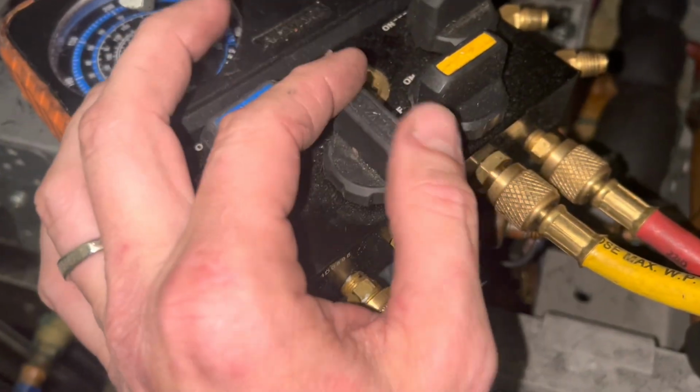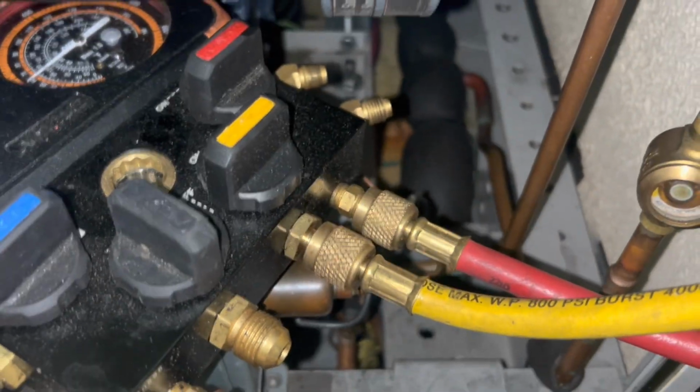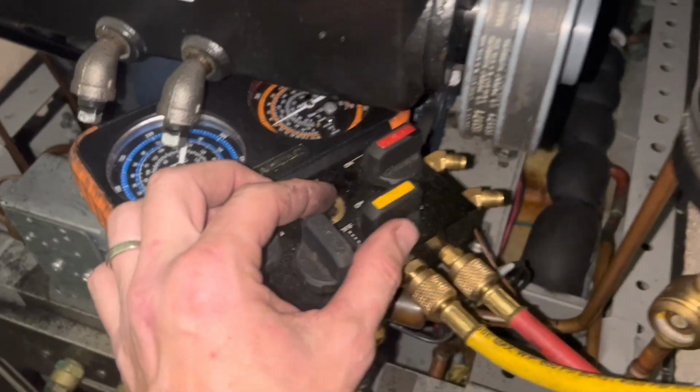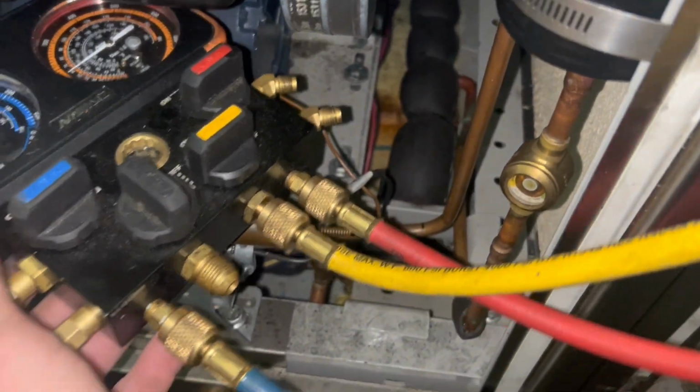Then, while it's operating at higher pressures, I will try and find the leak via various means, in hopes of identifying it. At that point, the machine's running, and I can quote them to repair the leak, replace the dryer, clean the refrigeration system, and replace the 10 pounds of gas. But basically, we're overspending a few pounds of gas right now for sure to get this thing up and running today. But that's what we're going to do.